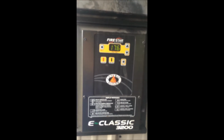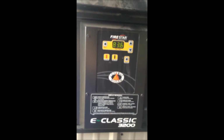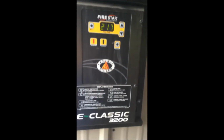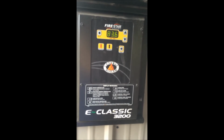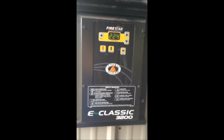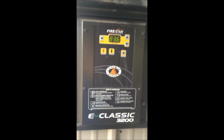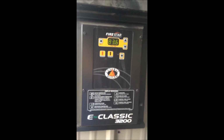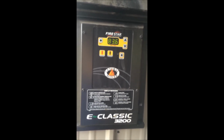That's what the LEDs there, the one on the left and the right below the thermostat, are. It goes into high burn at 400 degrees. As you can see, the video's just jumped up there. I did cut it. It's about 10 degrees every sort of 6 seconds roughly. The clock switches over, stays on 3 seconds on the current temperature and 6 seconds on the water temperature, so you know which is which.